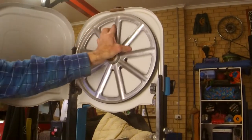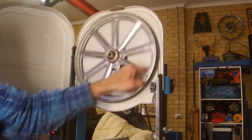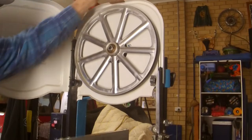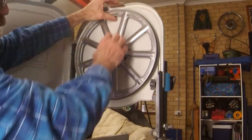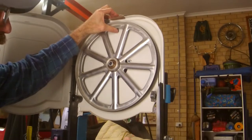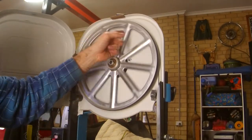The bandsaw has 2 wheels, and the band blade is one continuous blade. Bandsaws come in hundreds of different sizes. So this is the top. The top wheel is tensioned, and at the back of it can be aligned. The tension is how much tension is on the blade, so that will crank up. The tighter it is, the nicer, straighter cut you'll get. But there's a balance. If it's too tight, it's easy to snap blades, and we really don't want to do that on a bandsaw.